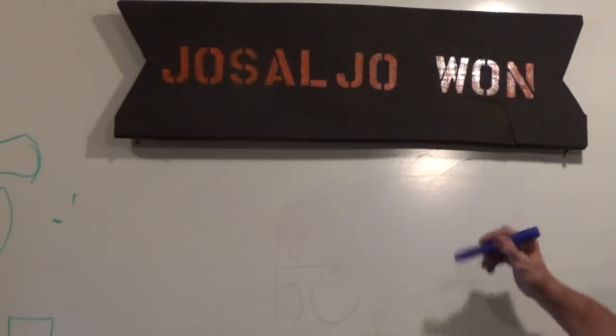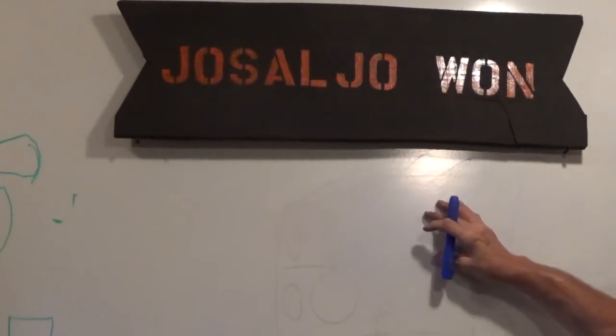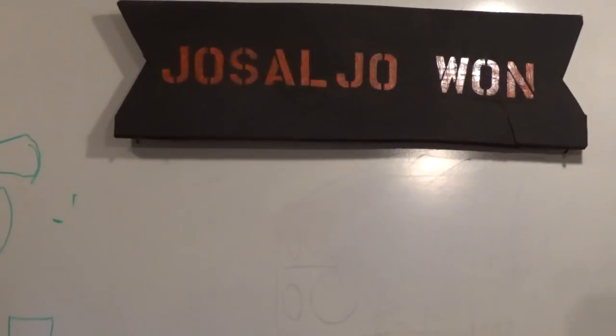At a rate, I should say. Because too much drying causes the wood to crack. So you've got to be careful. Now, can I give you an example of too much drying? I can show you wood that has been dried too much. It has the checks and cracks in it, or splits in it.